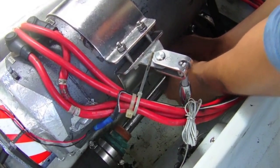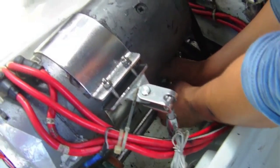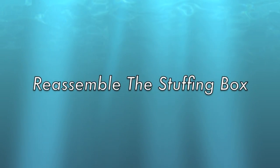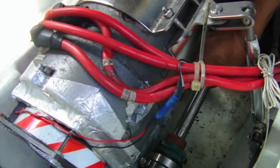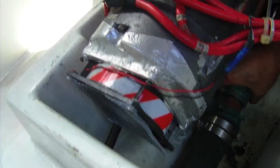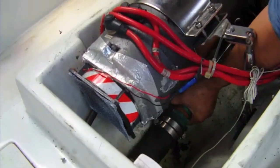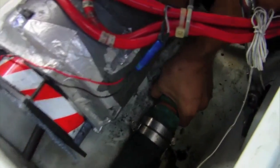Do not force GFO into the packing box — it should fit snugly and should be tamped in. Move the stuffing box coupling to the fixed portion of the stuffing box stem and begin screwing it on. As it screws on, it will compress the GFO around the drive shaft and begin to tighten.